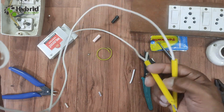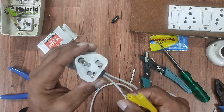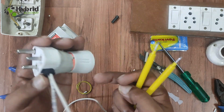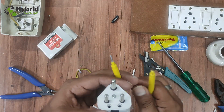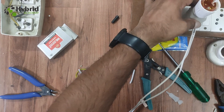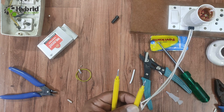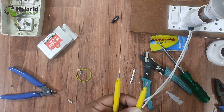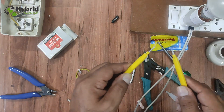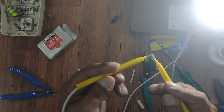These are the two wires and two probe points. The circuit is such that one cable goes directly into one pin, and the second one routes through the bulb holder. So once the bulb is fixed, the circuit will be complete, and we'll have to join the two probes to glow the bulb. This will actually help us check connectivity. I'm connecting this plug into the socket and fixing a bulb on top. Once I turn it on and connect these two probes together, the bulb glows — confirming the series circuit is complete.